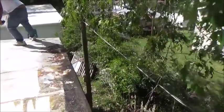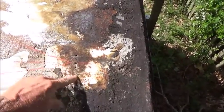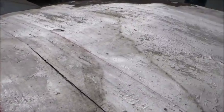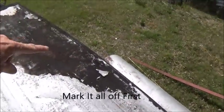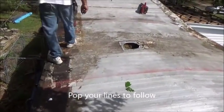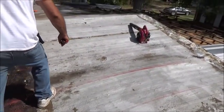What Chris is doing right now — this is an important step: find your rafters. We poked four holes there to make sure we found each side, then we pop the line dead center all the way across. We pop lines every two feet wherever there's a rafter. Chris is marking off where the 1x4 strapping goes, and we'll do another one and another one — there's going to be six or seven strips. We're putting everything on two-foot centers, not sixteen inches, so we want to make this thing strong.